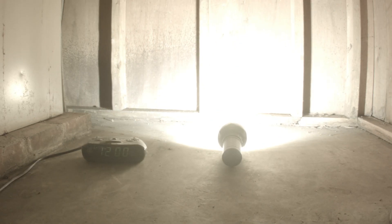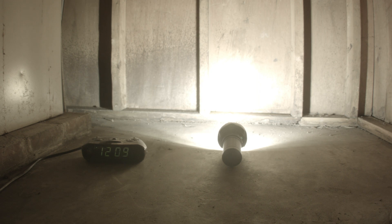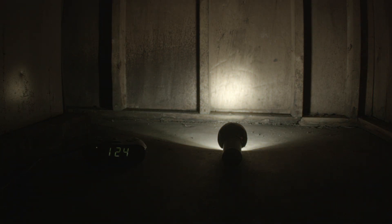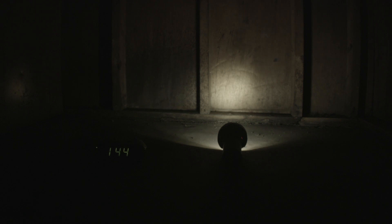First is Turbo Max. At 30 seconds by FL1 standards it's putting out 14,820 lumens. At 3 minutes in it starts to step down, stabilizing at 6 minutes at about 3,600 lumens. On Turbo Max I measured near the indicator light at 167 degrees Fahrenheit at 3 minutes in — that's extremely hot, so you need gloves if you're holding it on Turbo Max for long periods. At about 53 minutes in you get the red light, then it begins its decline in brightness until I cut the test off at 2 hours and 11 minutes. Battery voltage was about 2.48 to 2.5 volts.